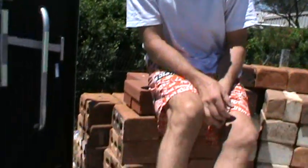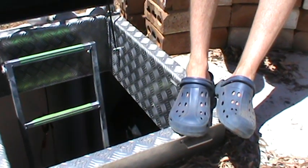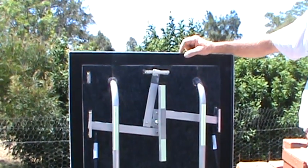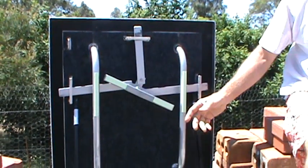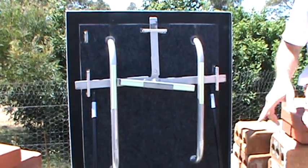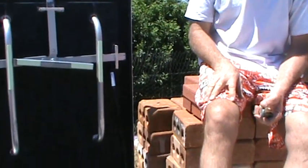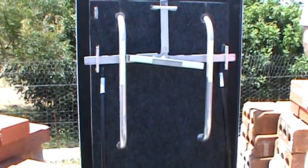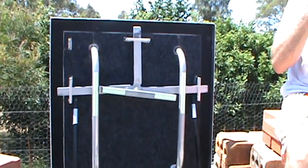The hatch itself is made from checker plate aluminium, six millimeter. I made it from that instead of steel because it's more corrosion resistant. The lid is made from three millimeter propeller plate — like checker plate, only with a single diamond pattern. It's got a lever I made up, three locking points, and the two at the back are hinged on gas struts to hold it up with good tension. There's also a bit of carpet and foam for air and heat insulation.